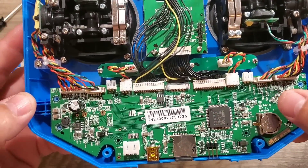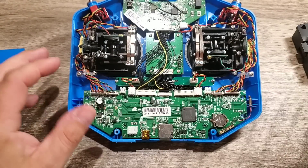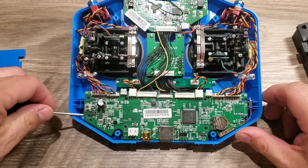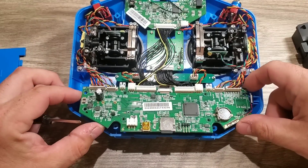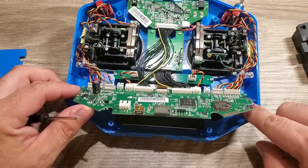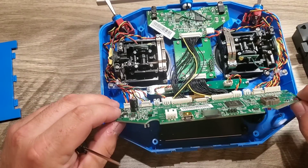We went ahead and carefully removed the screws holding on the main power board. Now we need to slowly and gently work this board up loose off of where it's sitting because it's kind of sitting in here a little snug. We're just going to move this board a little bit, being very careful not to damage any wires — just slowly move the board like so to get it loose. Once you get it loose, we should be able to flip this board. Notice the little vibrator here? That's what you feel when the Taranis vibrates. That's going to come right up off of the piece there. Don't worry about your knob if it falls off — that's not a big deal. You're going to lift this board up to get access to the back side. Watch your ribbon cables.